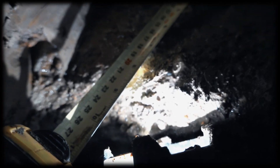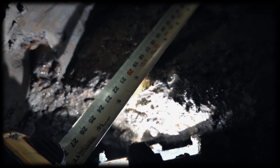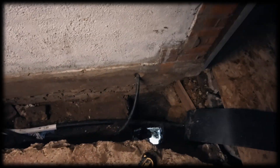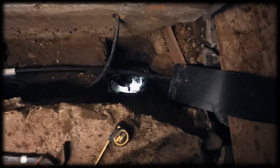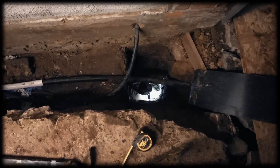We're ready to take the final measurement. What I've had to do is scrape out all the clay underneath and push the rule in right up against the underside of the concrete, so I've got a decent datum to measure from. The depth of the concrete is 200 millimetres. So the 200 millimetres plus the 800 millimetres of brickwork up to the suspended floor gives us our one metre depth of foundation, which is required. Fingers crossed the structural engineer and building control inspector will be happy with that, and then we won't have to underpin - which would mean four holes excavated either side of the wall, absolute chaos and a lot of money.